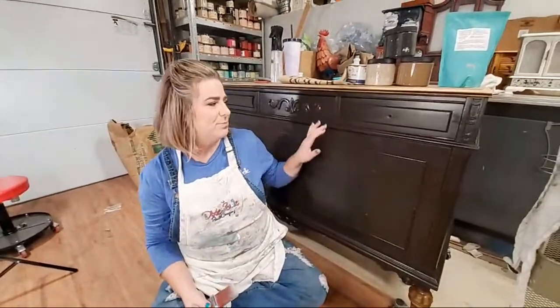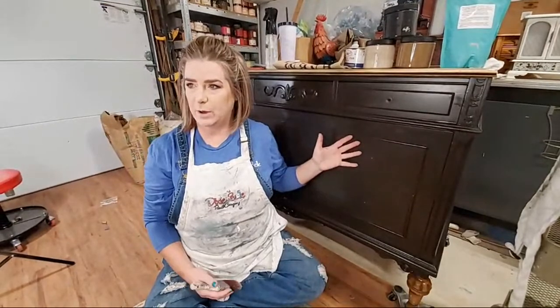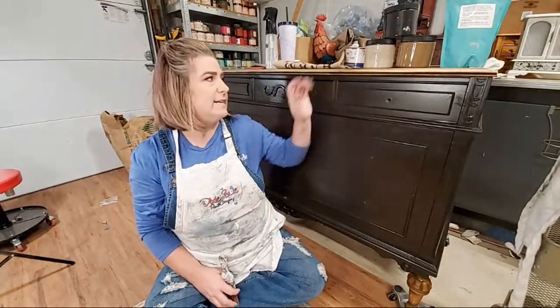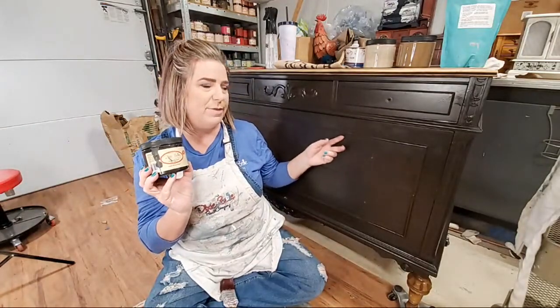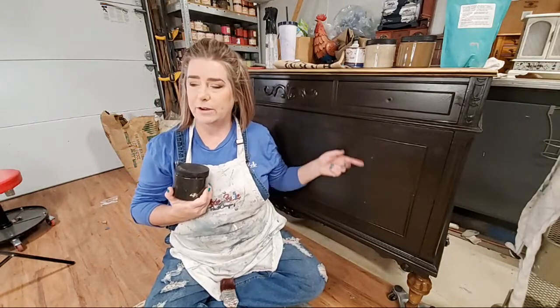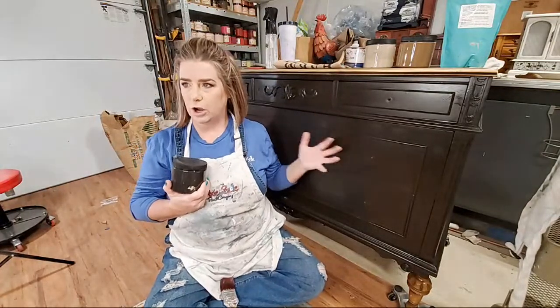I'm sorry about that. So this chest that we have here, I started out by cleaning it really well with Dixie Belle White Lightning. It was a bleeder, okay? The next thing I did is I gave it a single coat, just one coat of Dixie Belle Coffee Bean. Now, the reason I gave it some coffee bean is because I'm thinking about what my final look is going to be. I want this to show through from underneath my paint finish. So this is not going to be a color you really see. I actually wanted this to look like it was dark wood underneath for contrast, okay?